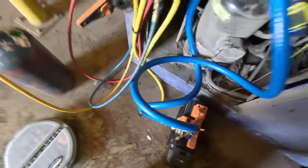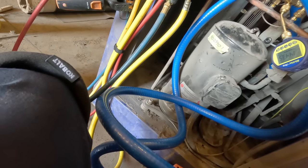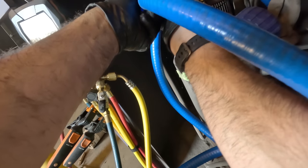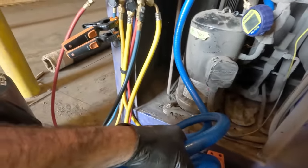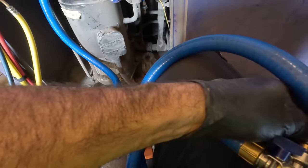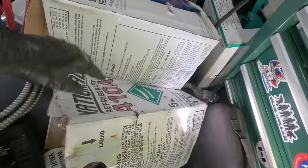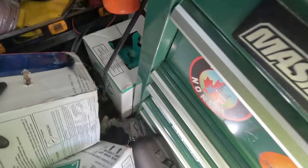Our vacuum is looking pretty good — we're at 1100. Let's isolate and see where we're at. Comes up to about 1400 — there's so much refrigerant in this thing. It's at 0.9, 0.8, it's slowing down — yeah, 1400. I've seen this many times. I'm not sitting here all day to pull refrigerant out of a system. I want to make sure all air, moisture, and any previous crappy repairs or charging procedures are all cleaned up. If it was left open, yeah — pull the oil out, put filter dryers on it, do the whole nine yards. But this thing has extra 410, 448, 507, 404, 22, 407C, 407F back here — it's just ridiculous. That refrigerant we came up with? Oh it's no good anymore, gotta get rid of it — yeah, never mind the patents wore out. It's global climate change. Still holding good vacuum — it's at 0.00 and not moving with everything valved off for a while now.